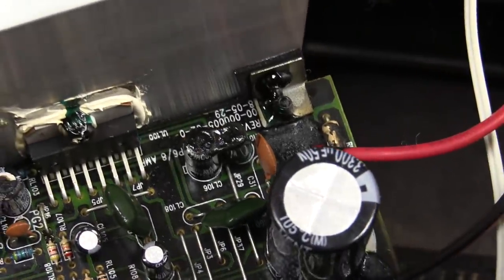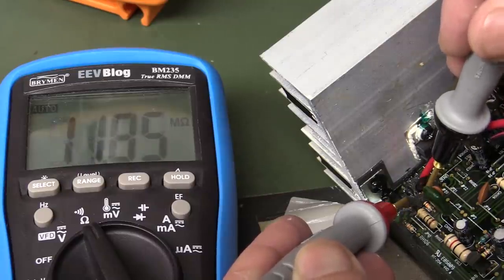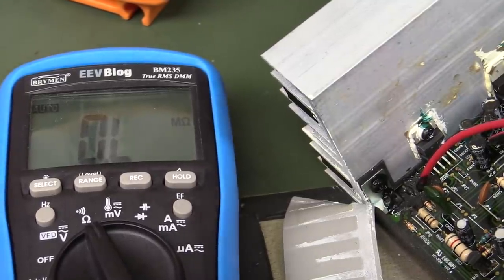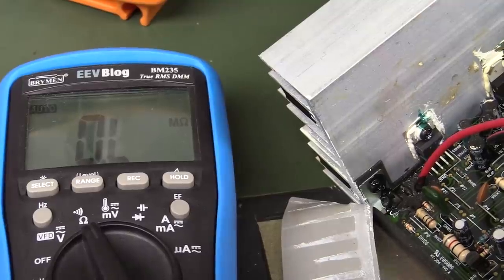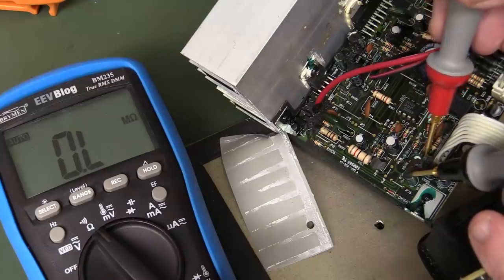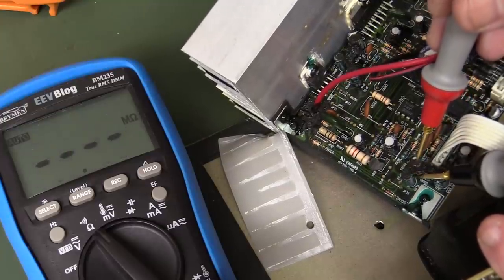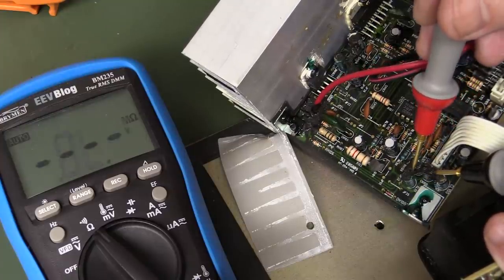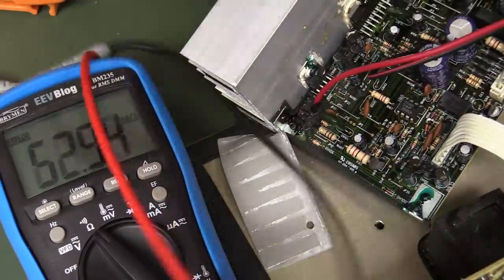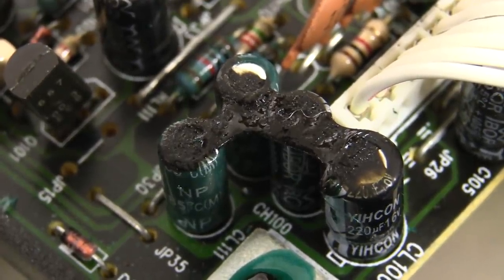It's horrible stuff. And sure enough — if I probe some of this gunk, I'm not actually touching a component there, and it's reading like a meg. That's just ridiculous. Why would you have anything in there that starts to go conductive with age or contamination, moisture absorption? Check out this insanity: if I measure on the top of these electrolytic caps that have been gunked together — look at that! I'm not even touching the top of the can and it's conductive. That can create feedback paths. Conductive gunk!